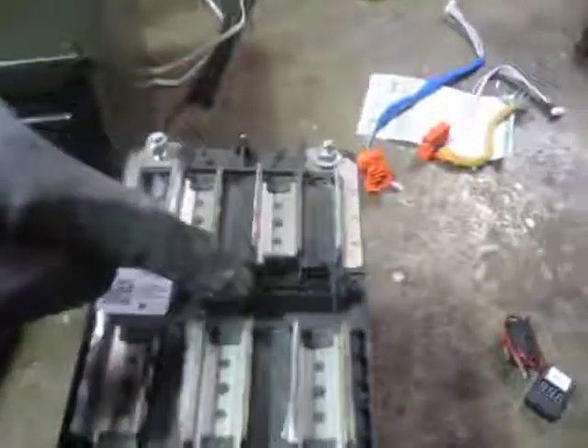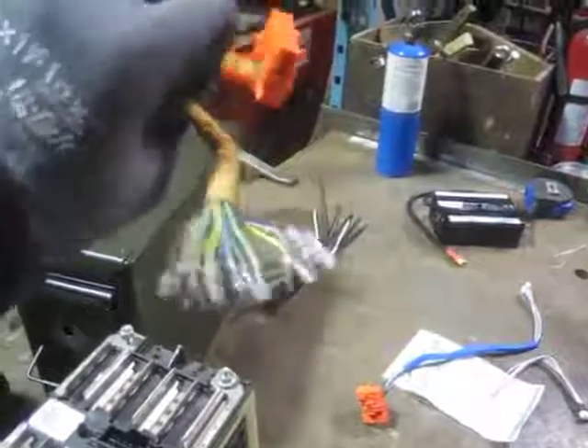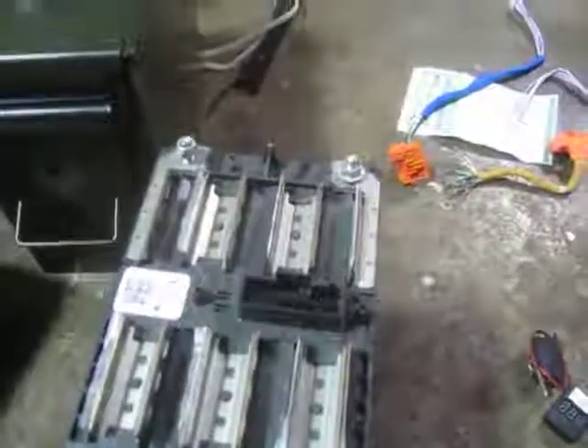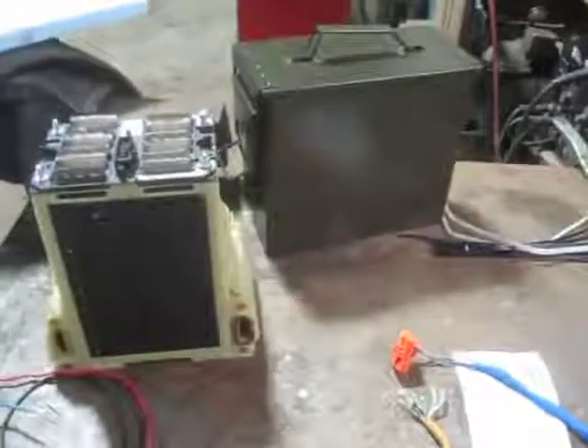The plug on top also has a harness — this is an original Chevy Volt harness pulled out of the battery. This one has more wires; it's for a 12-cell pack. But you can tear these apart and reconfigure them, and that way you can make something that hooks into that block connector and lets you balance the batteries as needed. Not that these batteries need balancing very often, but if I'm going to put it inside a box where it's really hard to get it out, I'd like to put in the balance cable too.